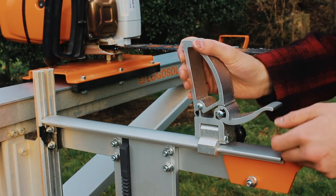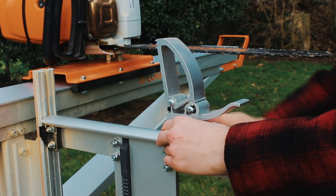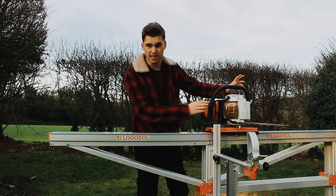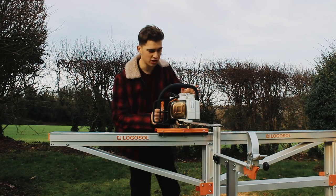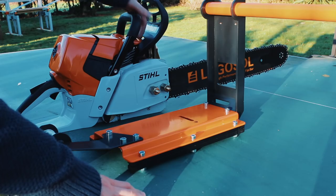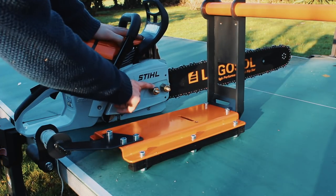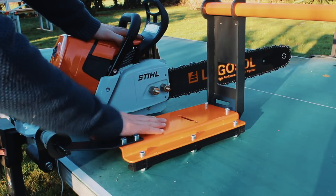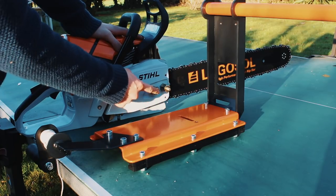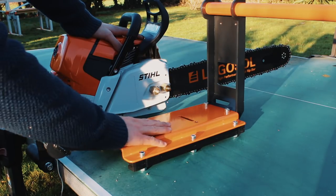The log lifters come with a cam locking system, so when you put the log on you just butt this as close as you can to the log and then tighten it like that. The chainsaw I'm using is the Stihl MS661, which is a very powerful chainsaw. The good thing about this sawmill is you can use your own chainsaw — you don't need to buy a new one. As long as your chainsaw has this style of locking system for the guard with the two hex nuts instead of the tool-less locking system, it should work. Logosol will supply you with two specialist hex nuts with another thread on the end so you can turn it upside down and mount it through these holes on the sliding carriage.